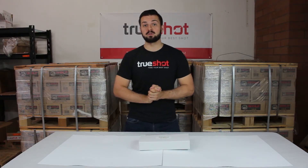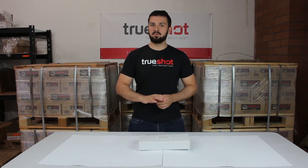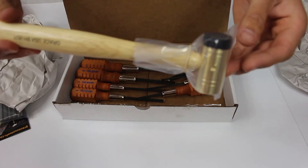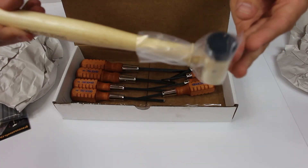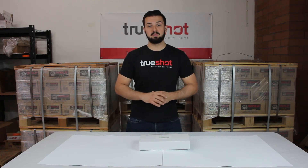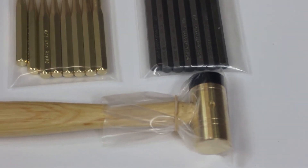The last item in this kit is the 8 oz brass hammer with Delrin tip. The brass head is hand turned the old fashioned way, one at a time, from CDA 360 brass rods and beautifully hand polished for a great shine. On one end of this brass hammer is the finely crafted high quality Delrin tip, which is securely locked into place and offers quick availability for a softer end when the need arises.